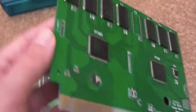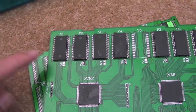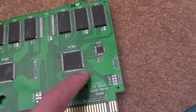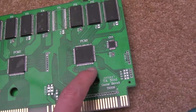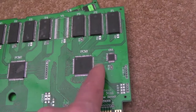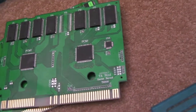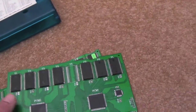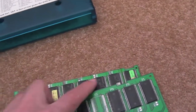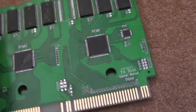One thing I've not done yet is re-solder all the pins on these C-chips, which will only take 15 minutes. Just get some flux on there — flux paste, the gooey solid type — put it all around the edges, then drag the iron across. Check it with a magnifying glass and multimeter if needed. That was how I did the Neo C1 chip, and how I'll tidy up the SRAM and Z80 later. I just didn't have any liquid flux at the time. I need to do the same on these C-chips just for peace of mind, because there could still be a dry joint.